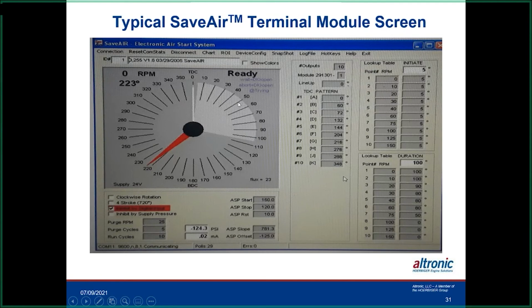So as you can see, the amount of air that's being wasted here, we don't need that now after the engine gets cranked up and running on it. And again, that's pretty much how you program it. In some cases, we've had customers actually put a negative number in here after they get the engine rolling. So they're actually, in some cases, injecting air maybe 5 degrees before top dead center, and then cutting it off real early afterwards, just to fill up that void on top of the piston.